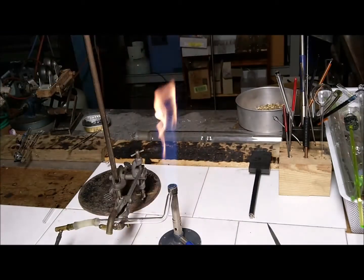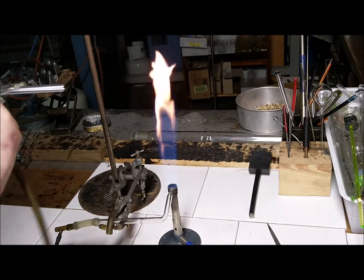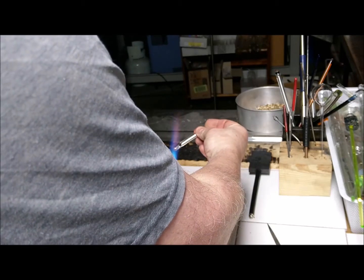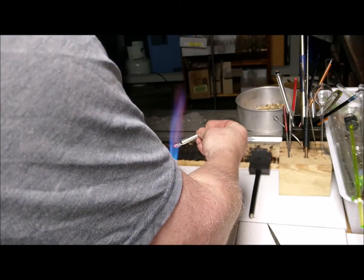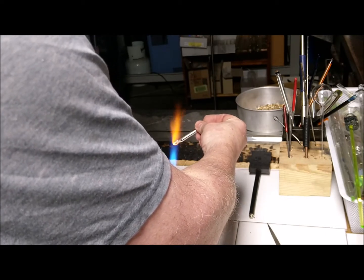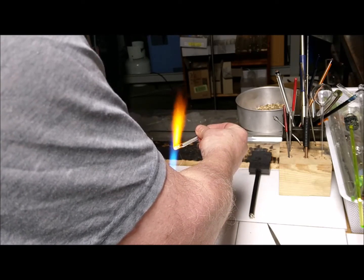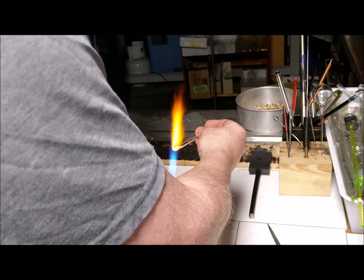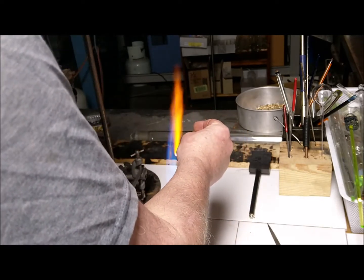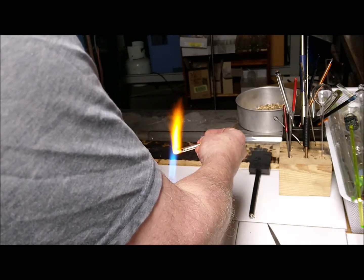Once you've got your glass scratched, you just need to give it a bit of a wet down with a bit of spit — if you saw that on the left of the screen, it has wet my finger. Now heat the blob of glass up that we made before, get that nice and hot, because we're going to use that to crack the glass off at the point where we've made the scratch. You could just use the scratch and break the glass using the traditional technique, but this technique is one that you get to use for larger diameter glass and will work for borosilicate as well, so it's a good technique to learn and practice.